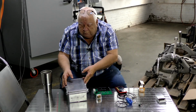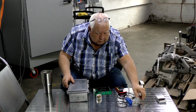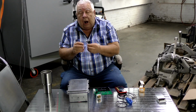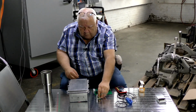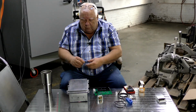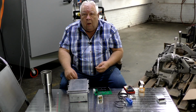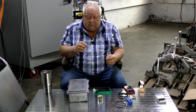Here's the thing in an enclosure, and we simply have the boards mounted in the bottom and wired to little 3.5 millimeter audio jacks. Our current flows on all this are going to be trivial, and they're not high voltage. We don't get 240 volts. We get 7 volts out of each of these, and we get a little trivial 50 milliamps of current, and with the resistors we have on the board, that winds up being about the same, 5 or 6 volts that we're actually measuring. By the time we scale that with resistors, it's between 0 and 1.1 volts on the input pins to the chip.